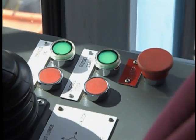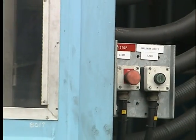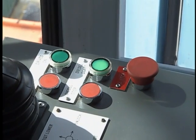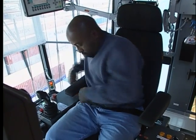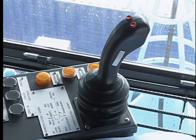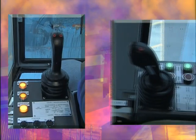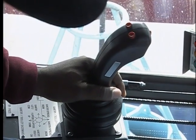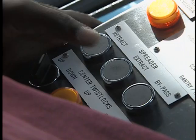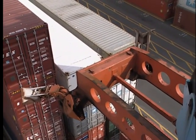One of the most important switches you need to be familiar with is the emergency stop button. There is one emergency stop button located in the cab — a large red button on the right control console. There are also two emergency stop buttons located on the ground on either side of the crane. Use the emergency stop buttons in emergency situations only. Before you begin any work, conduct an equipment check — be thorough, your safety is depending on it. First, turn on the control power to the cab. Next, check all crane motion controls for proper operation; these are located on the control levers commonly known as joysticks. Check the RTG's drive functions first — these include gantry, forward and reverse trolley, and spreader hoist and lower. Next, cycle the spreader through its functions: extend and retract it and move the flippers up and down. Report any problems you discover.